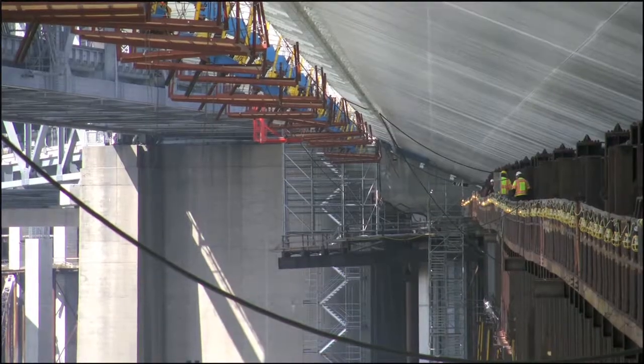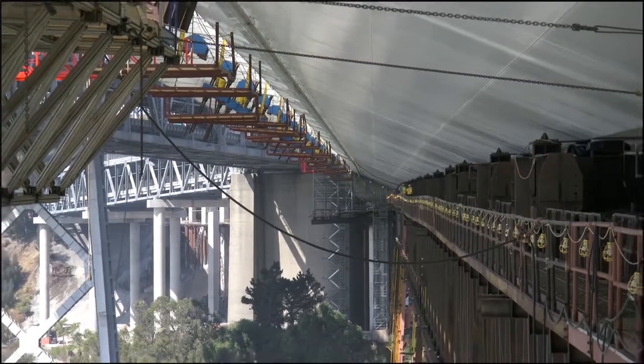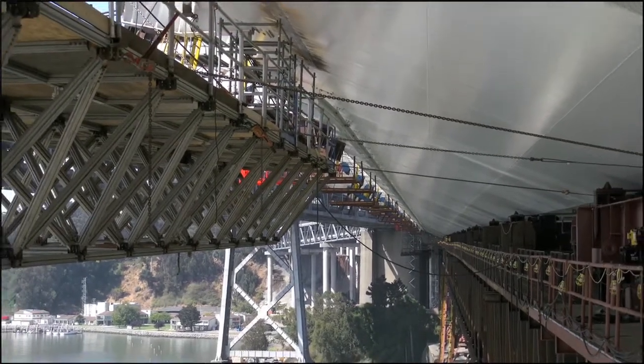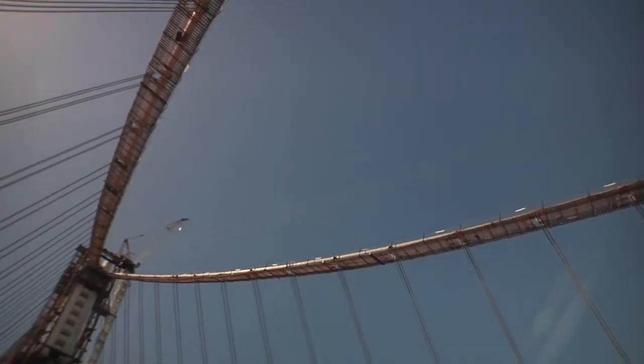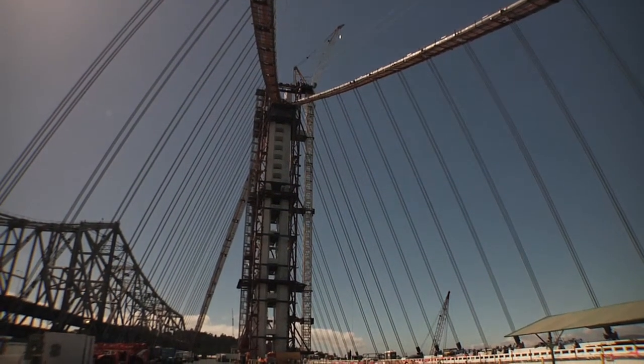One of the unusual design features of this new bridge is of course the steel portion at the deep water near Yerba Buena Island, where the bridge is a self-anchored suspension span. Unlike a traditional suspension bridge which has earth anchorages at either end — true of the west span of the Bay Bridge, the Golden Gate, and the new Carquinas bridge — our bridge does not have earth anchors. It anchors into itself. Since this is a self-anchored bridge and it essentially holds itself up, until we completed that engineering mechanism, the bridge needed to be supported on temporary false work.